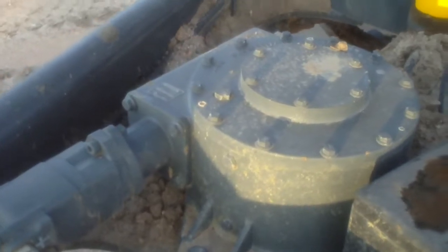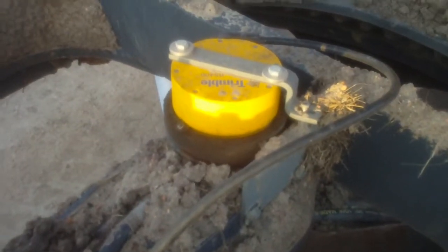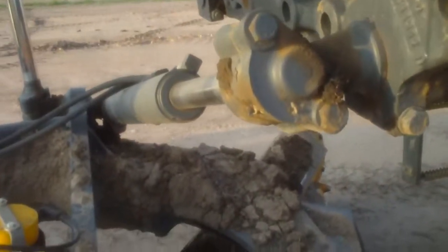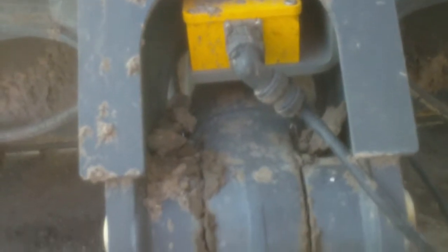That is the motor and rotation gear for the circle. It's a rotation sensor for the ATS system. We've got a lift cylinder. That cylinder shifts the circle side to side. There's our slope sensor for the ATS. That cylinder controls the pitch on the moldboard.